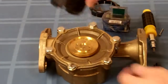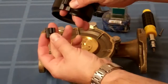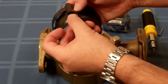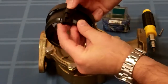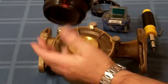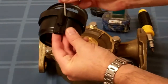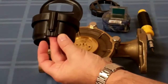There are two different ways to do it. I'm going to show you the long way first, and then I'll show you a quicker way. What you need to do is install this crimp slide into its appropriate place on the register — it just slides up there. What that does is we're going to set a screw through here, and when that screw tightens, it's going to crimp this and close this end up and tighten the register on the register plate. There is a right way and a wrong way to do that. We don't want to do it this way — that will make too much distance for the screw to cover. So we want to turn it the appropriate direction.